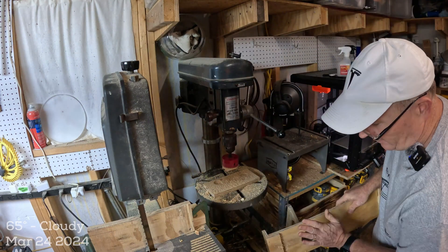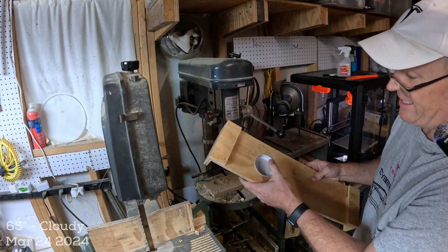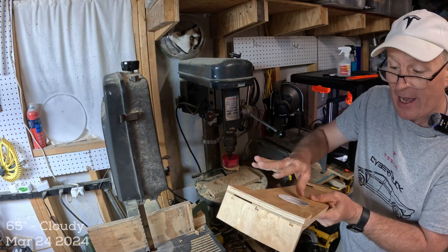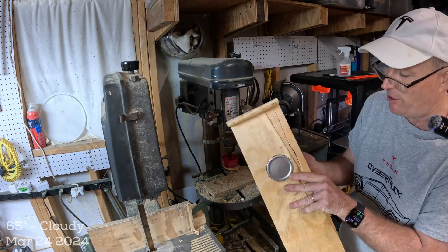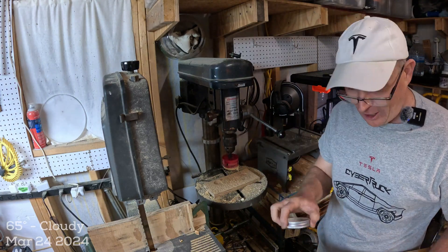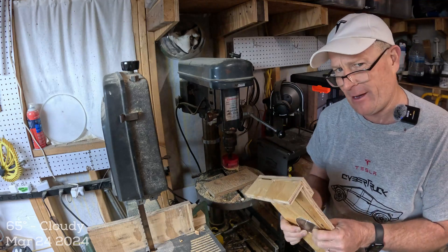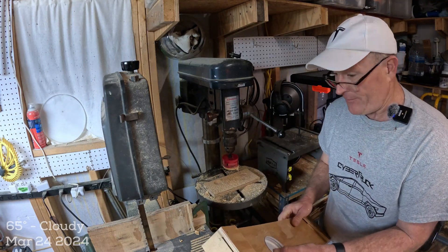About as simple as that. A little bit of sanding, get the dust off, and then this fits in there just right. You can see it's a little bit loose like I mentioned, but as soon as you put any paint — just a little rim of paint — it fits in there perfectly. I don't think 70 millimeters would work; I think that would be too small. 71 is the right size. It just needs a little paint or beeswax to make it a tight fit.